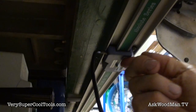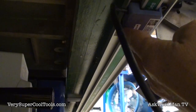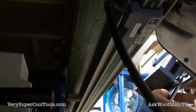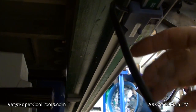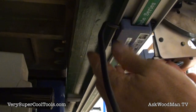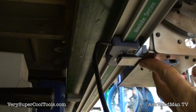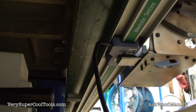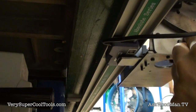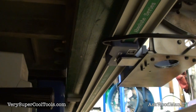Here's the encoder that slides along the digital track down below the digital scale, and here is my tipping bracket. This moves up and back out of the way. This little plastic tab has the female portion on it, and then the encoder has a little male node. All I have to do to engage them is just reach up underneath and feel until they mate to one another. Then I just have to put a light tight on my pivoting bracket. Here is the encoder cord — I just slip it right through that access hole and pop it right into the digital readout, and I'm good to go.